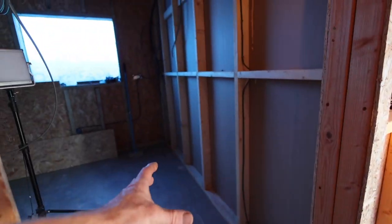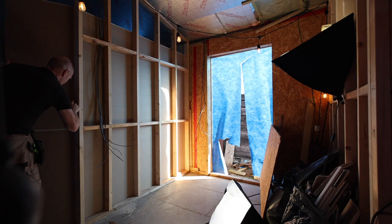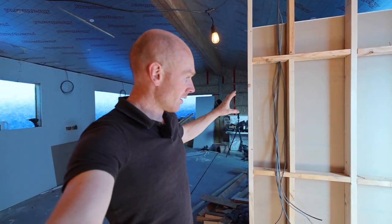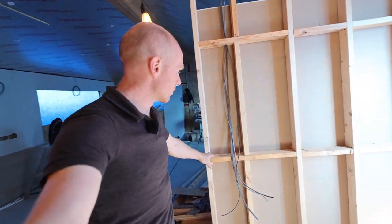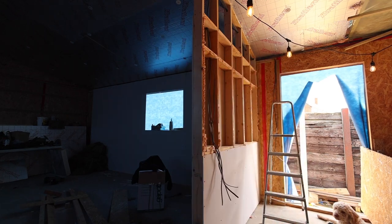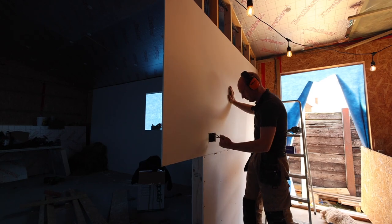Because if you come in from the front door, this is just going to be the mud room - boots off, wet coats hanging up, that sort of thing. The eagle-eyed amongst you will notice we are short of a few noggins here. This wall was going to be clad in a horizontal shiplap or tongue-and-groove style, so we were focusing on getting the uprights in the right position, just equidistant to split it up. It turns out now because we're plasterboarding, these don't match up with standard plasterboard widths. So I'm going to put in some extra blocks - should have done it beforehand, but we were just getting on with it. That's my first job: cut those blocks in and then we can do the same from this side.